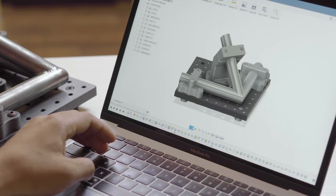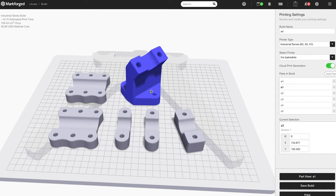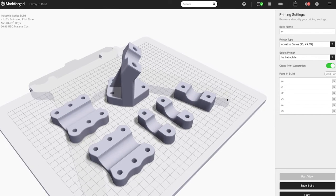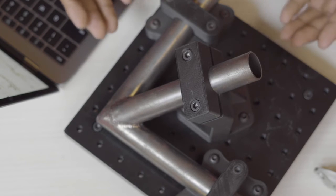These tubes were held in place exactly where they need to be, which would be tricky to do with regular clamps. Our welding fixture was created with 6 parts total, 3D printed at once in a single job with integrated hardware. The steel tubes were tack welded in place and can now be transported so they can be welded to a larger assembly. With foresight, complex geometry, and low volumes, 3D printing custom fixtures makes it easier for you to complete welding jobs more accurately, quickly, and consistently.